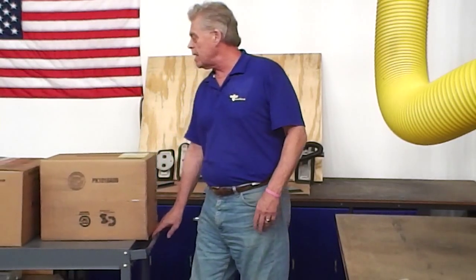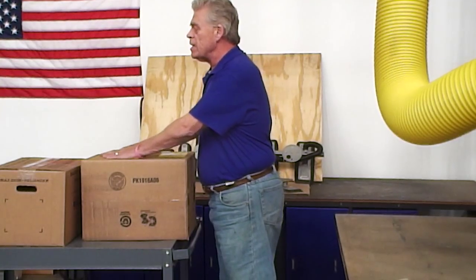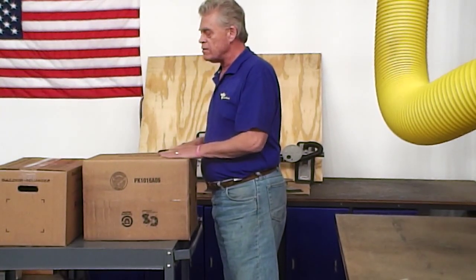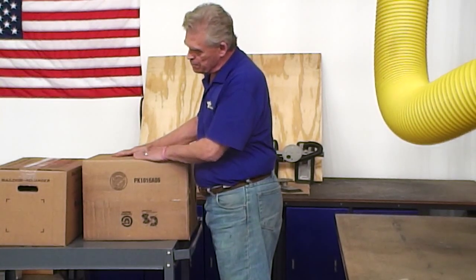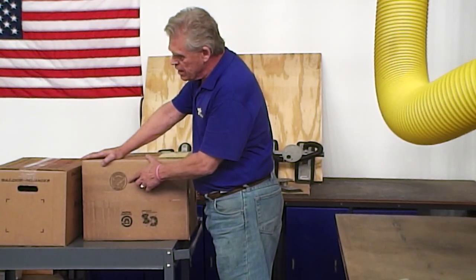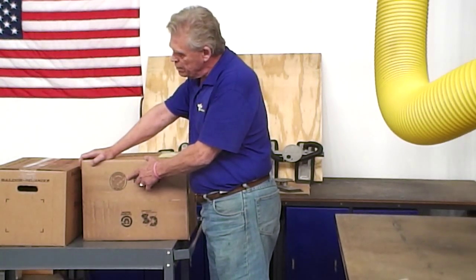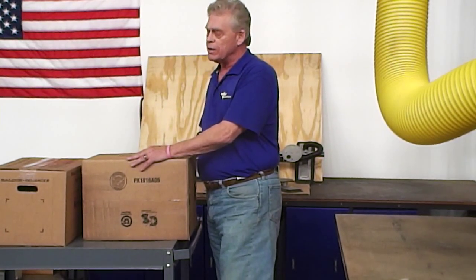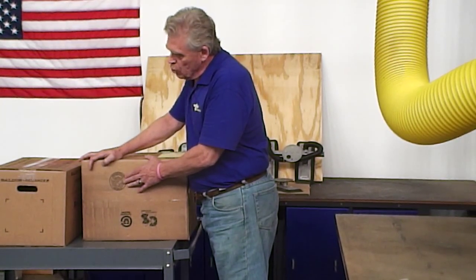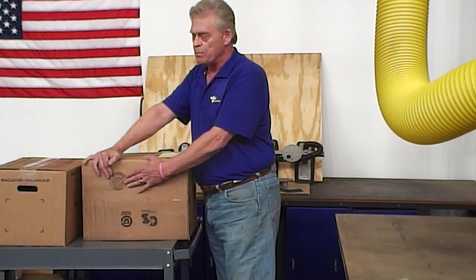Now, all corrugated boxes are porous, and the question is, are they strong enough for us to lift, and is there perhaps too much porosity? Most boxes have the manufacturer's box certificate on the bottom. This label will give you some parameters on the strength of that cardboard. The one parameter that is most important to us is gross weight limit.